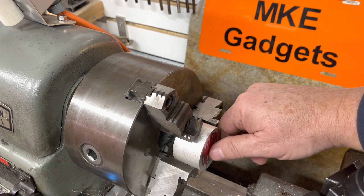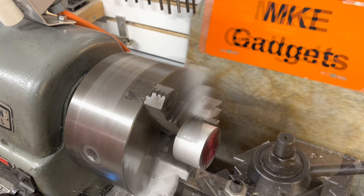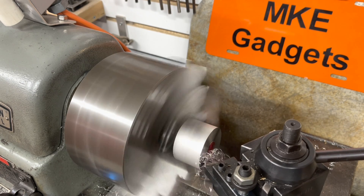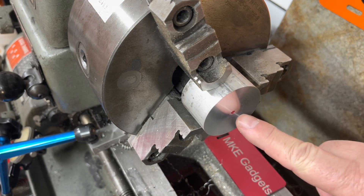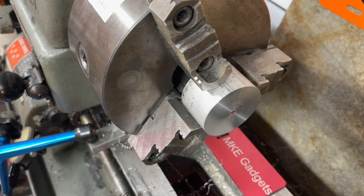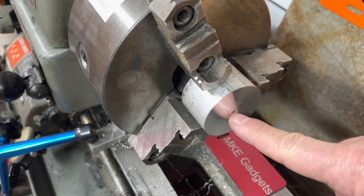There's a little raised part here that could break the center drill or push it off center, so I'm going to take a pass. After repositioning the camera, you can see I didn't clean up — there's still a little raised part, and that tells me the tool is too low. Your tool should be centered on the axis of the spindle, the chuck, and the part. If I take a deeper pass like this, it would be a real problem.